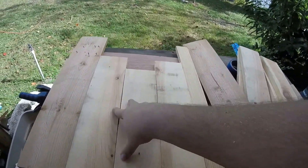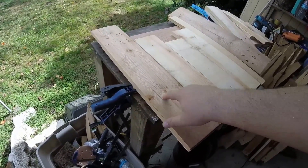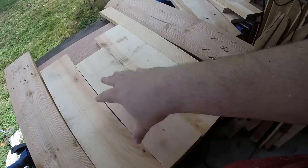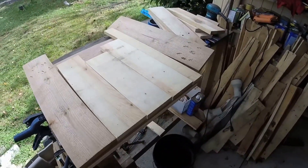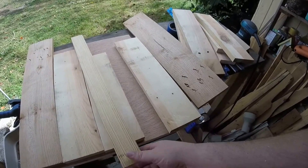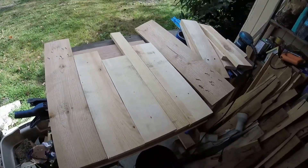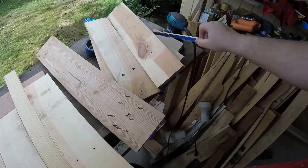I'm going to get matching sides to match the doors, leaving any maker's marks or branding — this is rough-sawn on the back. I'll match them as best as possible, and once I have a matching set to pull a door from, I'm just gonna pocket-hole the thing and glue it all in place. Then get everything glued, squared up as nicely as possible, and make a door. Then I'll trim it out.